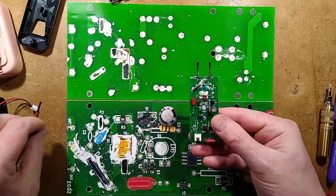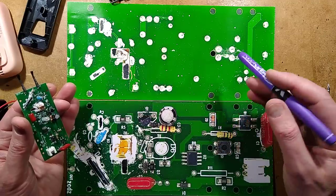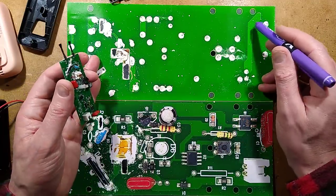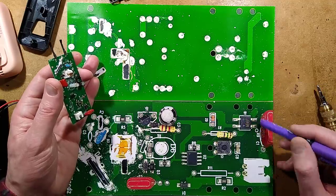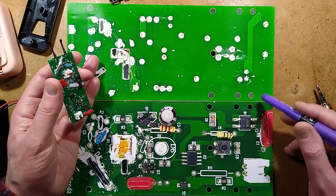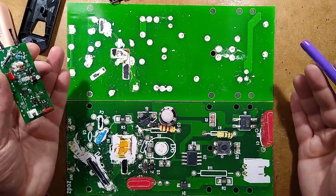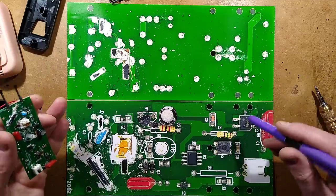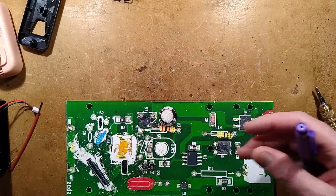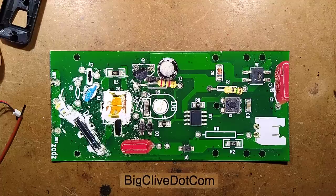It's actually quite a nice design, but a bit odd because they've used a double-sided circuit board, but they didn't really need to use that, but they always use it anyway. Every track, including this one here, could have been done differently. They could have taken the capacitor over to this pin of the rectifier and then just taken a direct link from here to here. It's very strange that they've done it this way. And there's also some circuitry oddities. But anyway, we'll get rid of the back of the circuit board here and we'll take a look at the front and I'll show you the key components of this.